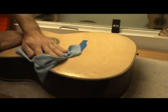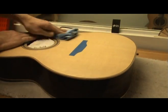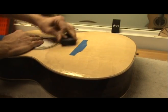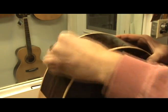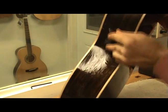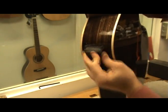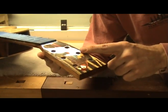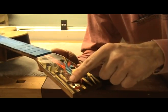After a few minutes of sanding, wipe the water off the surface you are leveling. As the surface dries you will see that the shine has gone away. If it hasn't, keep sanding until there are no more shiny spots on the surface. You want a nice satin finish that is completely level. The trick is to not sand through the finish and into the wood if using lacquer, or not sand through the top layer and into the next layer if using a product that builds in several layers like urethane. Sand the entire guitar with 600 grit sandpaper. Don't use much moisture around the tuner holes in the peg head as it can swell the wood and cause problems with the finish — sometimes I even dry sand this area.